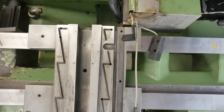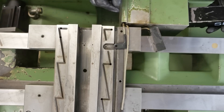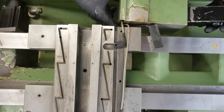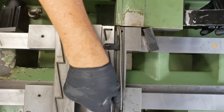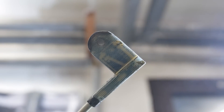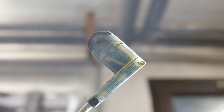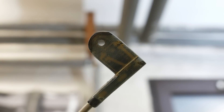There were some suggestions last week about replacing these proximity sensors, which are Hall effect, with more modern standardized industrial sensors. But the cool thing is the way they've been molded to go into these pockets — I kind of like that and don't want to change it. This is such an elegant solution I prefer to keep it. It looks like they've just cast the Hall effect sensors into epoxy in that form, so I'm guessing it's probably not an off-the-shelf part but something Schaublin did in-house.